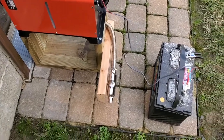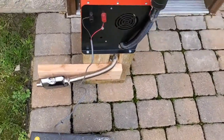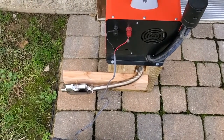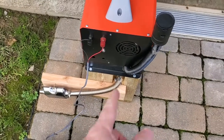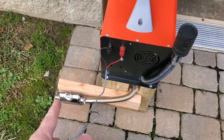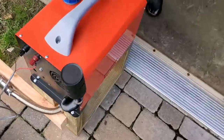But one thing I learned too online, there's a couple videos out there. Some gentlemen do some really good work with explaining all the error codes and the routing and all this stuff. They say with the exhaust, only put at most a couple of curves, because if you do more than 270 degrees of curving, you know, like 90s, you're going to start kinking it up. But I only have two bends in there right now.